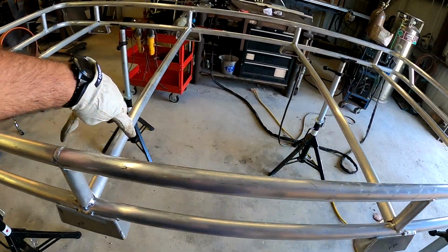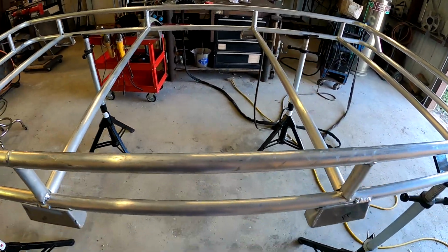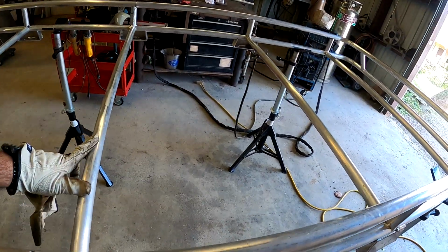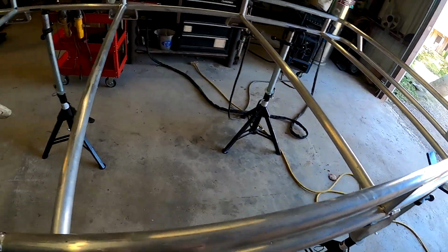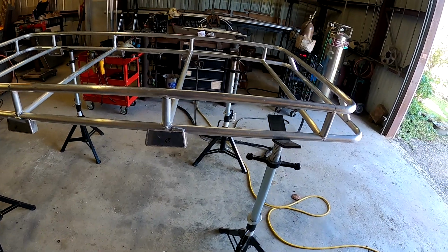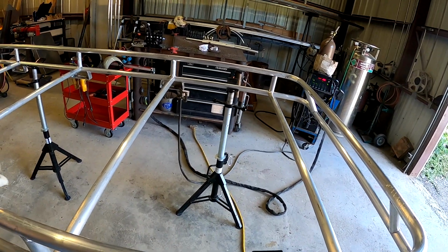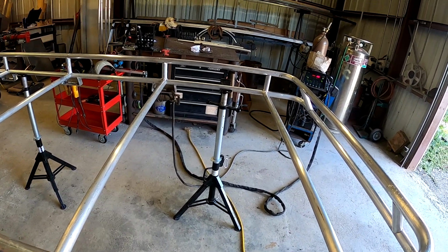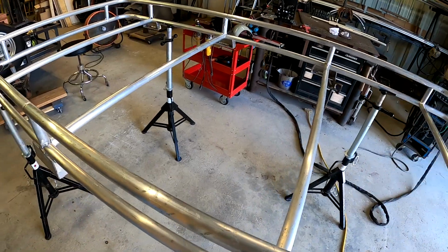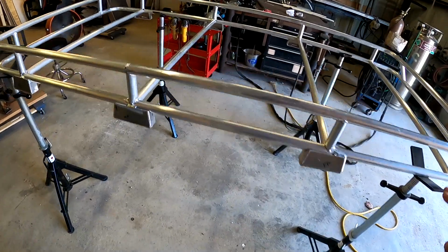So I was going to cut each individual plate and put it down inside here, but then I thought, if I do that, then it's out of square, then I have to try to trim it, make it fit. So I'm just going to go right on top, all the way across them, so you really won't be able to see that anyway. But my problem is the dimple dies to fit in a press like that, so when they come in, I'm hoping that they have a hole all the way through them, so maybe I can use an impact and a nut and bolt or something like that. So I'll cut all my holes in there and then I'll dimple die it. But really and truly, I don't even have to put holes in it, being that I'm going on top.